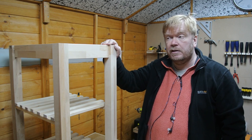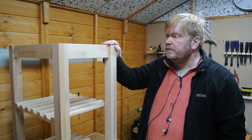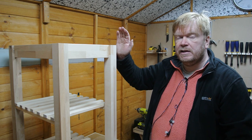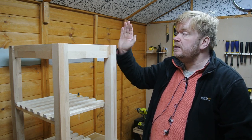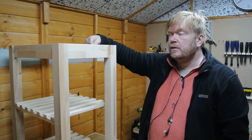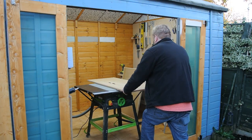So we've made the kitchen island narrower. I've taken some measurements off the top and I need to cut two pieces of MDF. I'm using 18mm MDF for this, at 375mm by 520mm, and that will form the top. Once that's done, we'll be able to finish the project. So back to the table saw to rip the MDF to width.